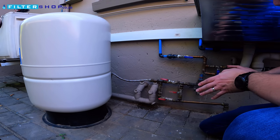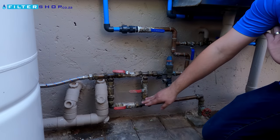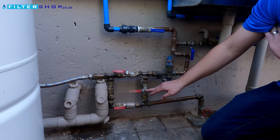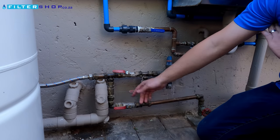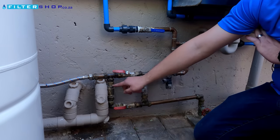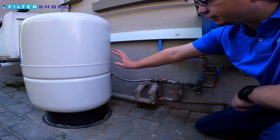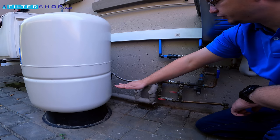What we've got set up here looks quite complicated, but we have our incoming water coming in. Here we've got a valve to shut off the supply to the tank, a valve to bypass the whole system to the house, and a valve for the other side of the tank. We also have a non-return valve, which allows water to come in through it but stops it pushing back if you lose your water supply. Then the tank has a bladder inside that pushes the water back out using air pressure.